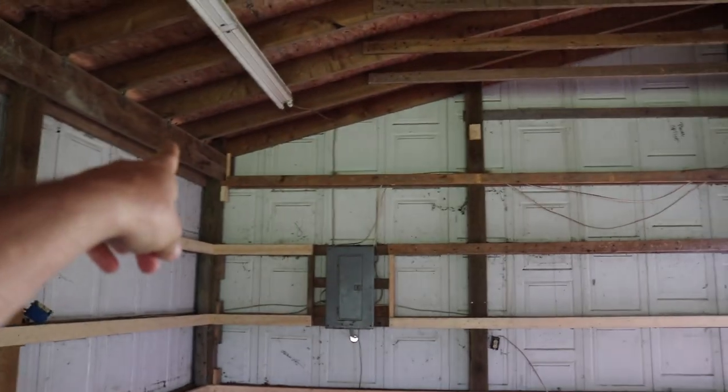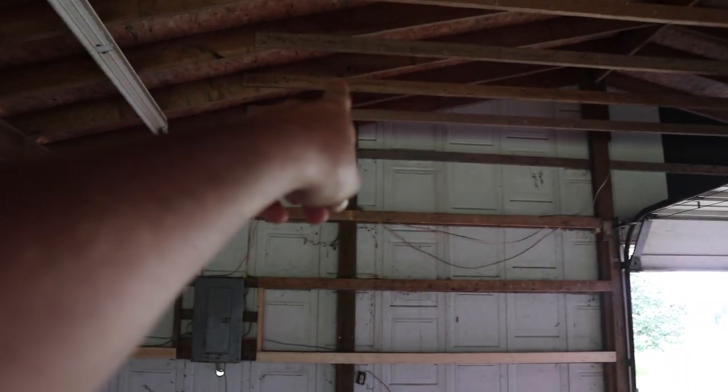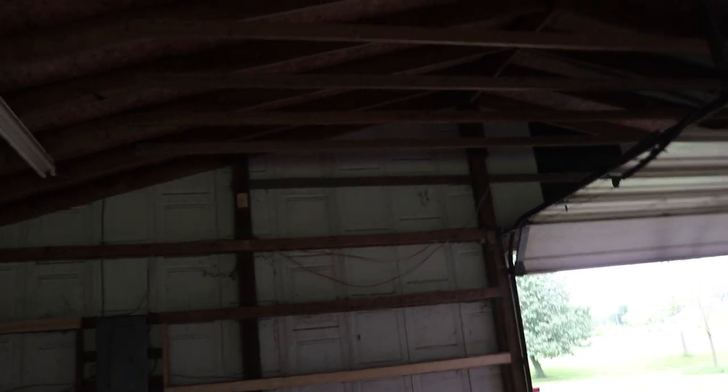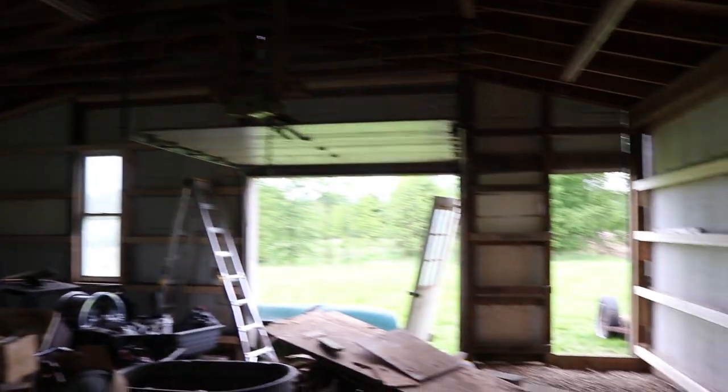I miscalculated by about one board, so I need to put one on top of that header board from that post up to the next one, run a straight one all the way across the top, and then a small angled one down there — really just two 16-foot boards. Everything else is framed up and ready to hang the tin. Super pumped about the progress. I got this old wall done and made a correction with a board I'd hung improperly yesterday.